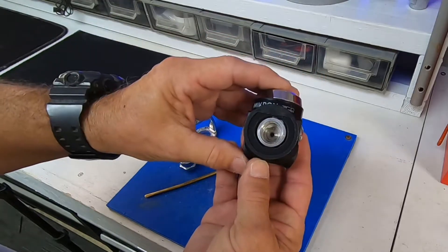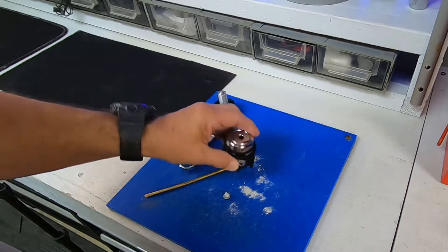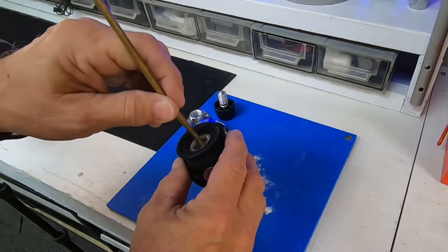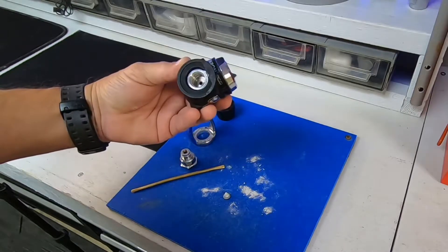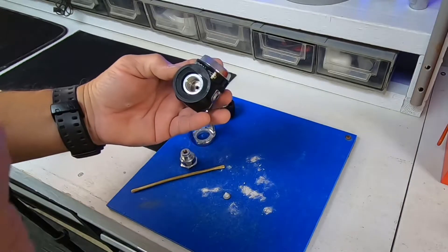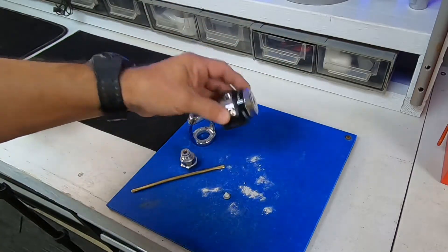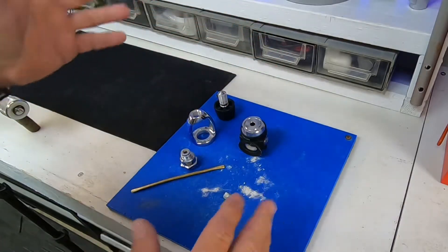There's still a little bit more corrosion inside — I'm going to try to knock this out. This regulator needs to be taken completely apart, given a good ultrasonic bath, and then reassembled with new parts. This contamination is too much; it obviously got past the first stage into the actual filter area and could be throughout the regulator.